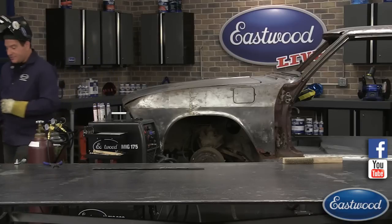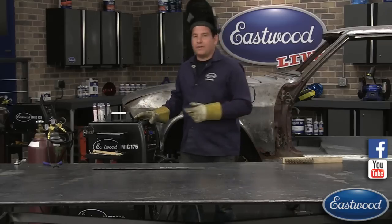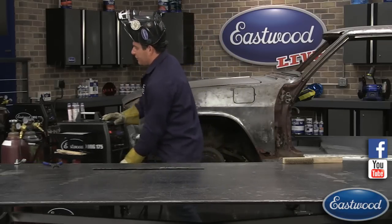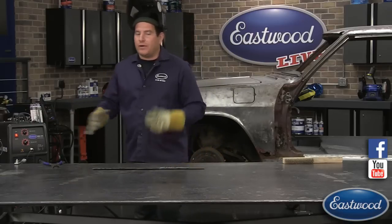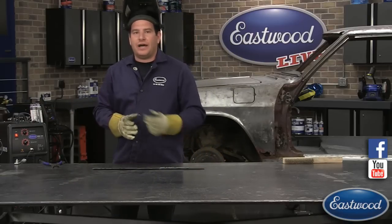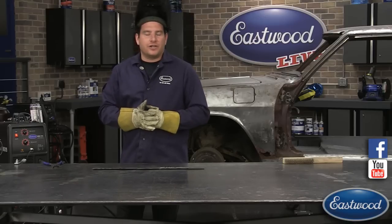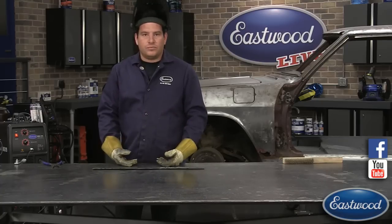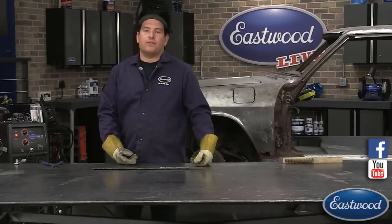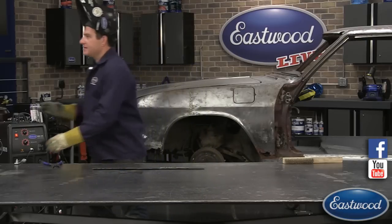If you start getting into some higher end welding, you may find that you can use a different mix. But you do use a mix when welding with a MIG welder like that, whether it's 80-20 or 75-25. You're going to use some kind of mix commonly. You do not want to use 100% argon when using a MIG welder on normal steel. Only use that for when you're welding aluminum. So that's a good question. I skipped over that. Any others?